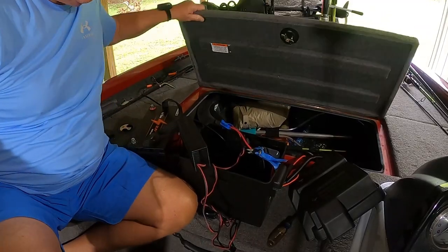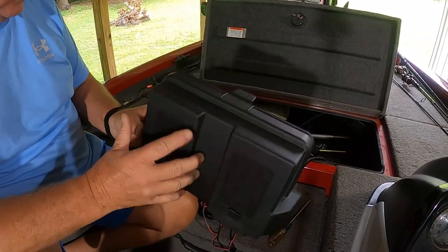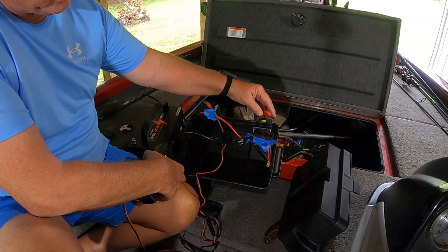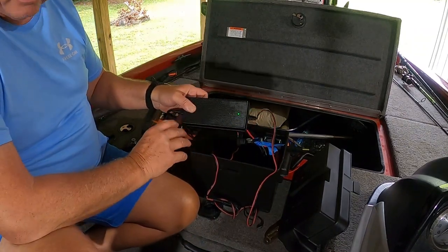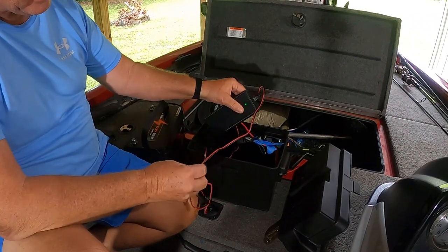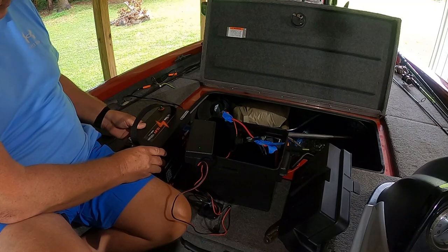Let's go out here on my boat. I'm going to show you a little bit of the setup and give you an idea of how I got things using that battery. I got this in a compartment in the front here at the bow. I just set it down in there. I'm using a Group 24 case for this Mini 100. On the case itself, I put a master switch on the back of this box so that at the end of the fishing day I can just cut everything off. You got to use a lithium charger for a lithium battery, and I got that running out through a small hole at the bottom. I keep the charger inside the box with the lithium battery — it fits pretty good on this 100 amp Mini.